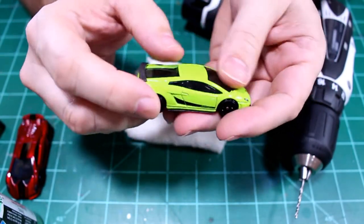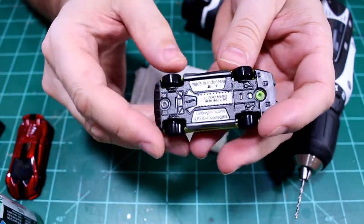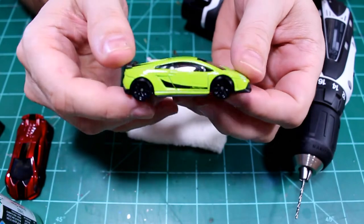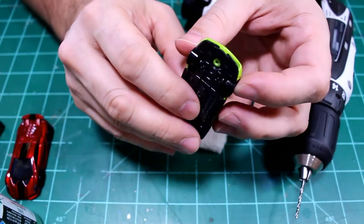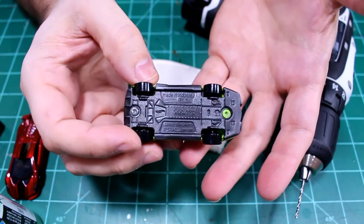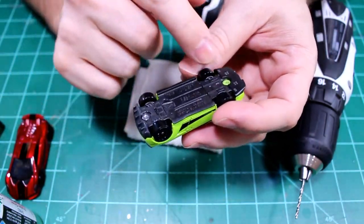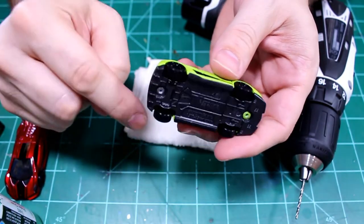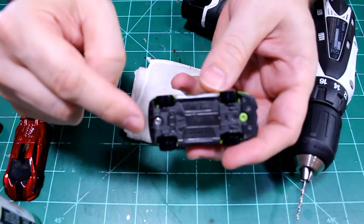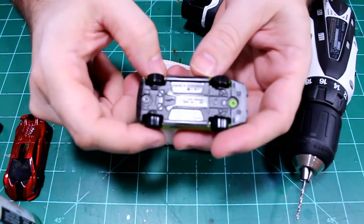These newer castings - that post underneath the base is almost always perfectly straight. You can't really count on that with the older castings, but these newer ones are done with such exactness that you can get away with that. So what I'm going to do now is start my hole, which I'll finish later. I don't want to go too deep now because you can go too far, but I will start the hole and then finish taking that mushroom off.